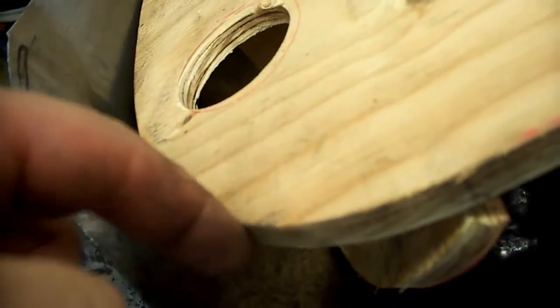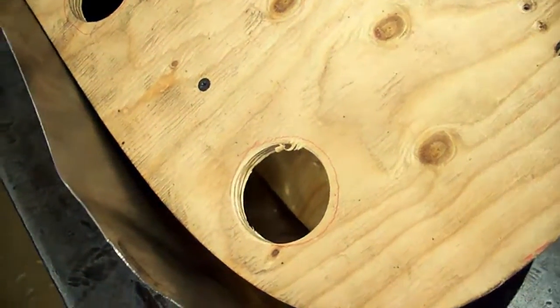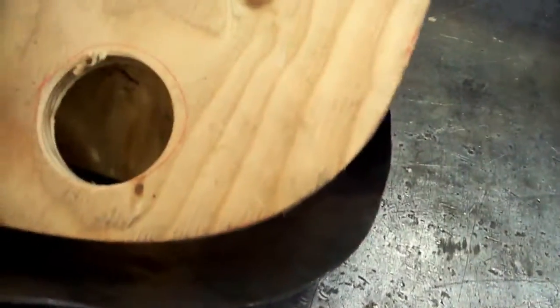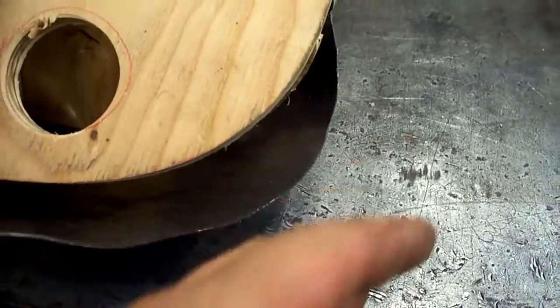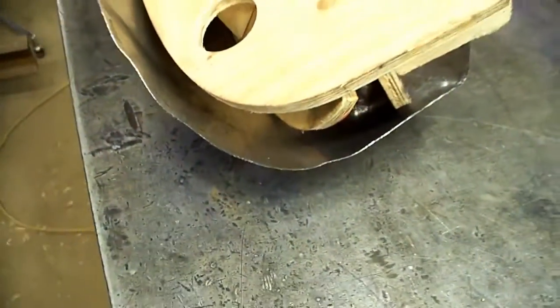You see, we got to get our sheet metal up to our mark here, and this has got to get shrunk around, and this has got a ways to go. So we're going to keep working on the shrinking side, get that shrunk around, and we'll keep fitting it to the buck and making test fits, and we'll go get all this material brought around here, and we'll trim the top. We'll mark the sides for the flanges and stuff, and we'll get going on that.